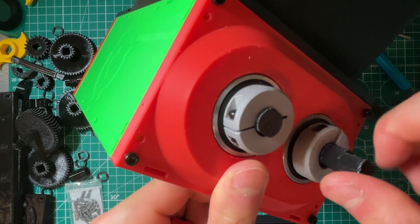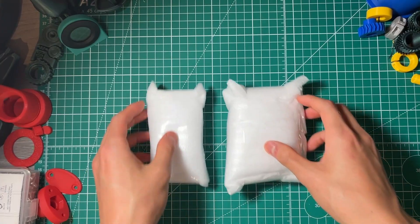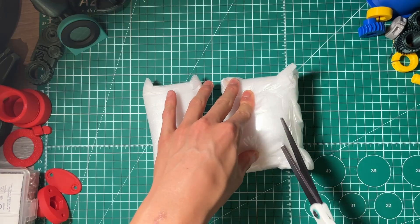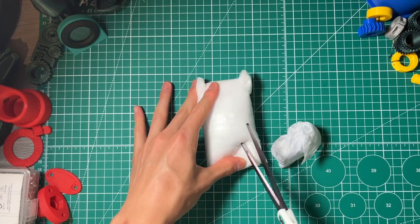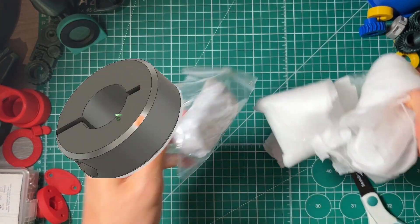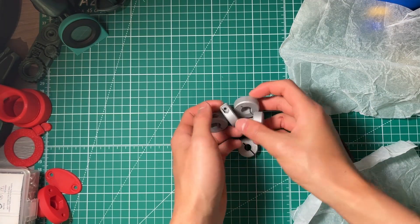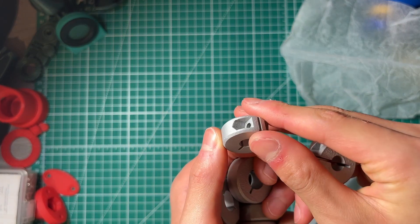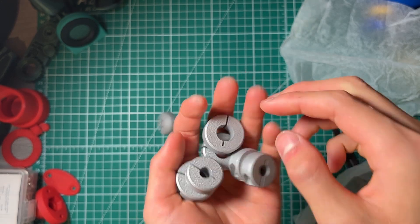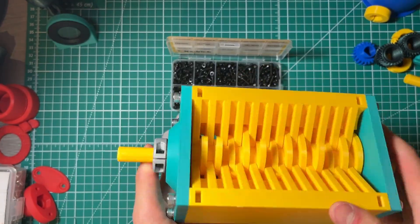These shaft collars are made out of 3D printed aluminum, and that brings me to the sponsor: PCBWay. Plastic shaft collars are fine for light loads, but for high stress I needed something tougher. PCBWay helped me metal 3D print these collars in aluminum using SLM 3D printing, where a laser fuses fine metal powder layer by layer into a solid part. I sent them my parametric Fusion design, chose aluminum AlSi10Mg, and a few days later the collars arrived — light, incredibly strong, and I can tighten the set screw without cracking or deforming them.